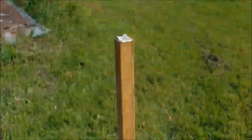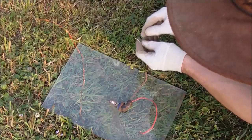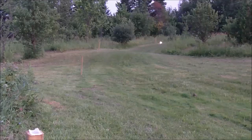You can see that it lights up very dimly on this end. I have a 12 amp heat gun and a 300 watt spotlight hooked up. I don't think the heat gun is actually turning on, but you can see how dim the bulb is now — it's very dim. So we can't get much current down at that end with only 120 volts at this end.